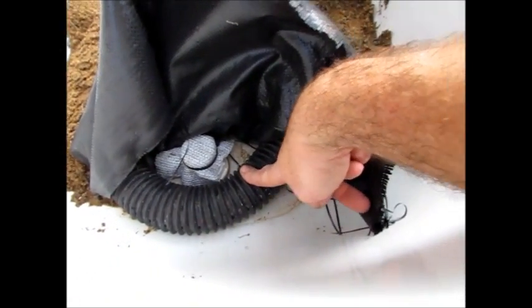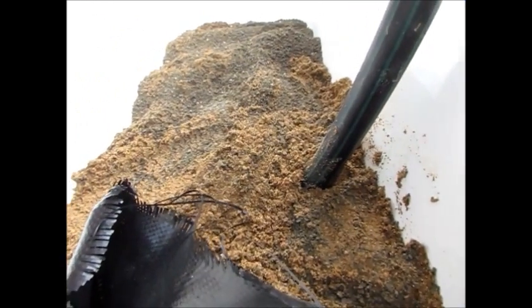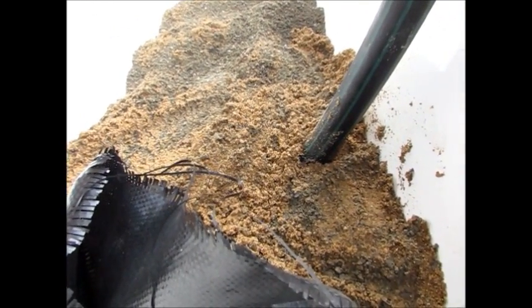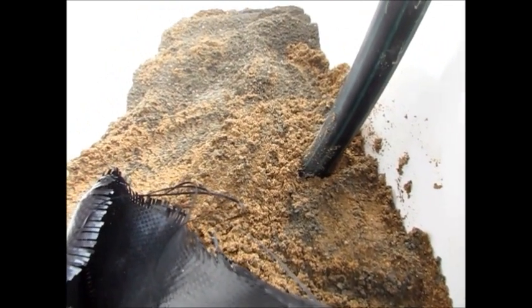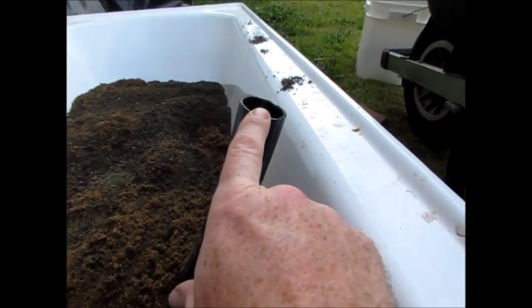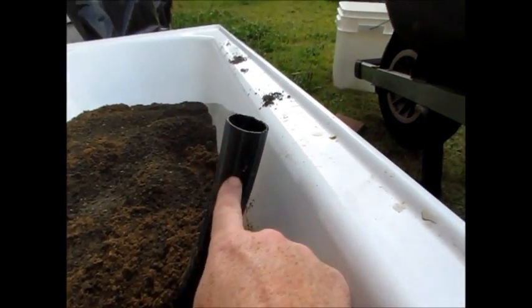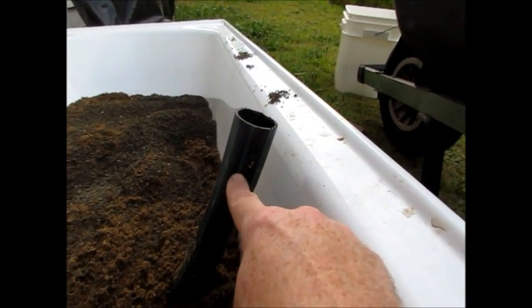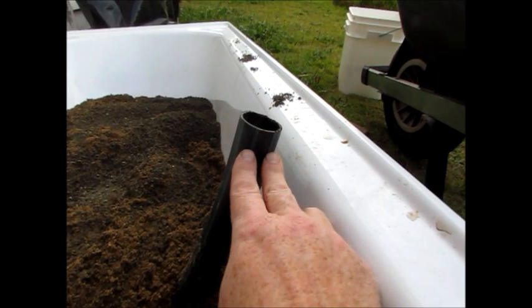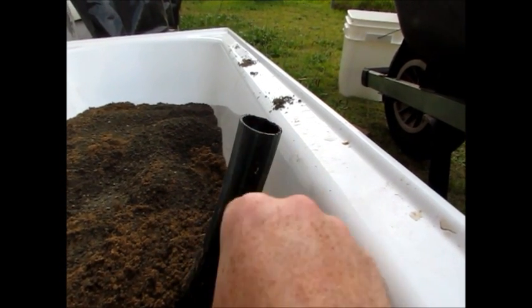That's the pipe in place, and I've just got a small loop of it there. And where I've joined the pipe around onto itself, probably should have shown you that. I cut out of the end pipe, imagine this is the end of the slotted ag pipe, that stuff there. I actually cut a V out. This pipe here is down in the far end of this V, and then I've squeezed it together and inserted it into the other end of the ag pipe to make a loop.